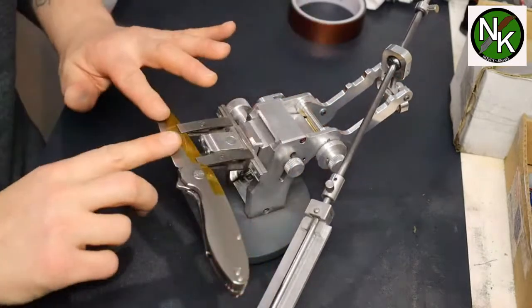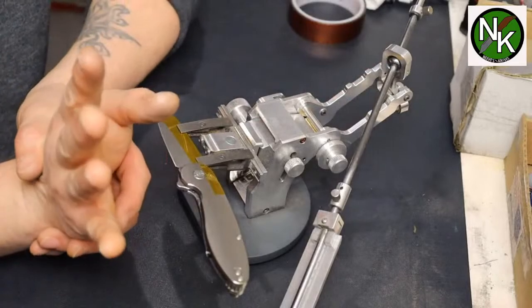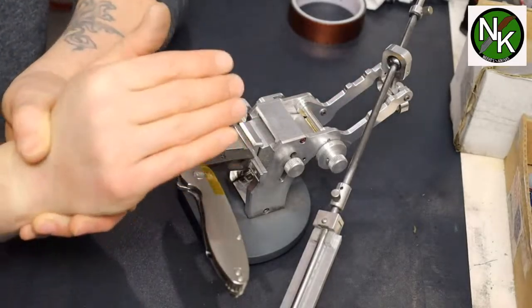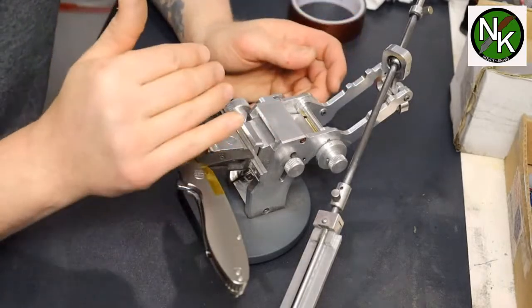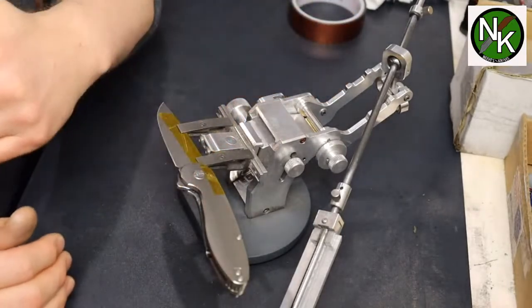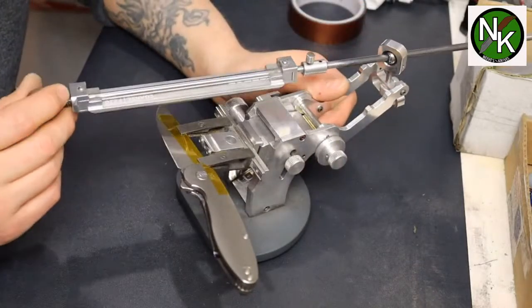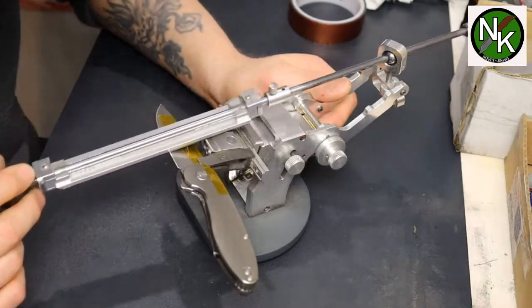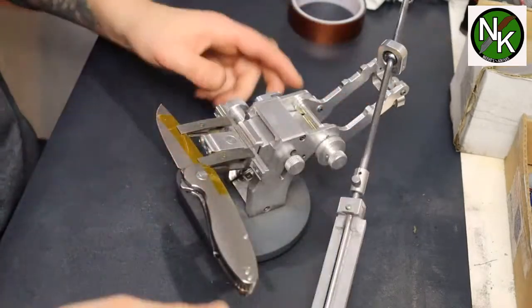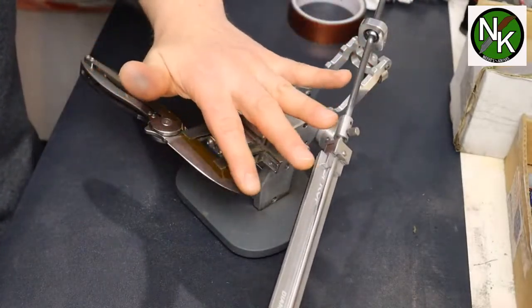Now I'm going to go to this side. The teeth are back on this side because some teeth do go back and forth. Like if this is the burr, it'll go back and forth. But my goal is to rip them off. So the ones that do fold back and forth, I want them to break off or get ripped off. And they eventually will, when they're fatigued enough. The strop will help that too. Right now I do still have some burr.